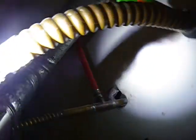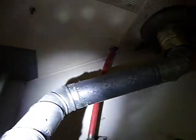These water supply lines: you're supposed to have an escutcheon plate there, and these water supply lines should have been insulated. This red PEX was insulated in the attic, but the white pipes that we started this video with are not.